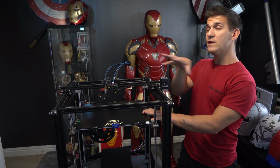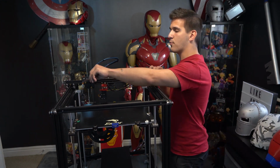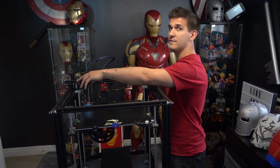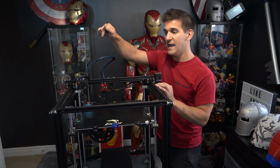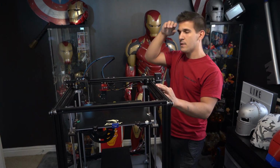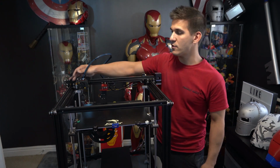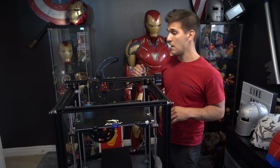When the print does finish, the nozzle does auto home approximately all the way to the left, and when you turn it back on, what will happen is your BL Touch will actually hit this rod over here and go tink, and it'll go into an error state. What I've started doing is right before I power the printer on, I'll just move this over and then power it on, and the BL Touch can fire up properly.